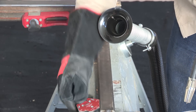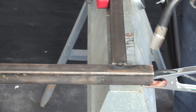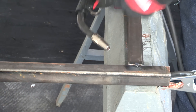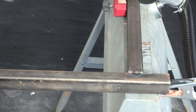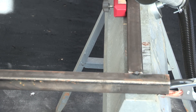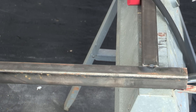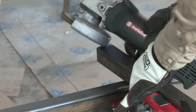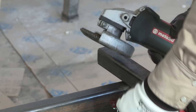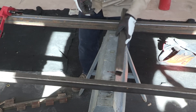Once I got a couple of tacks in there, I can take this mini angle off and set it to the side. I'm going to tack on the back side. Our settings are perfect — I set the machine up for 10 gauge .035, right in the middle, wire feed speed and 18 volts. I just got the first piece tacked into the bottom part of the railing. A lot of people don't take the time to get all the mill scale off and the rust, which makes it harder to get the arc started with MIG welding.